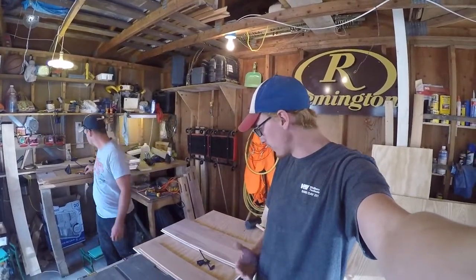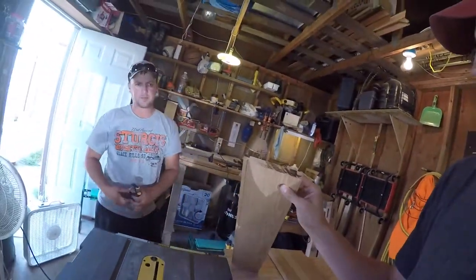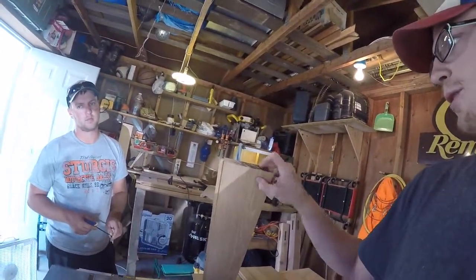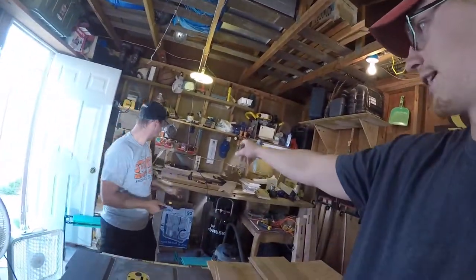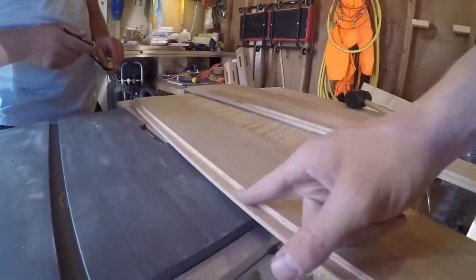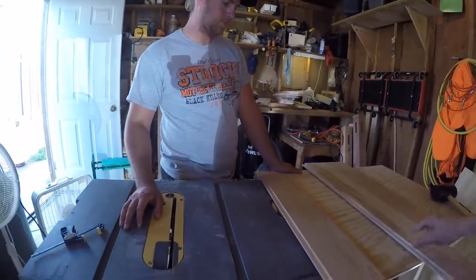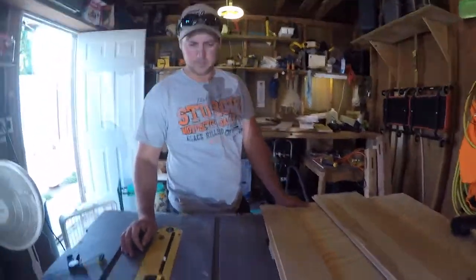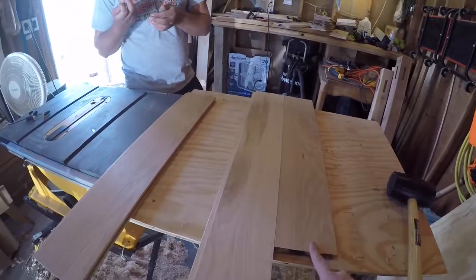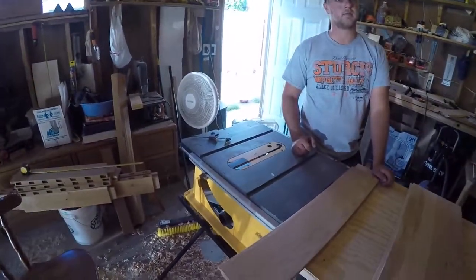We've come to the point where it's time to finally start putting these back slats together. We've got the tongue and we've got the groove. We made the groove a little bit smaller than the tongue, so we've had to take the 1906 Stanley hand plane — and it has been working like a charm. It's just smooth, working really well. So that's doing the job just right for fitting these in. Once we get them all together, I'll have to cut these sides down since it's only about three inches that I need out of this board, and then the other side too. That should be easy once I get the exact measurement of where it needs to be centered.